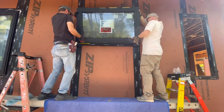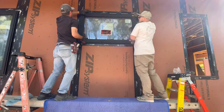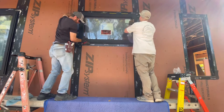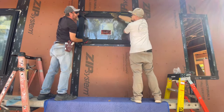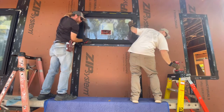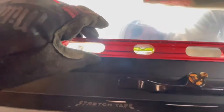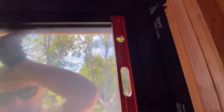We're just careful with it, careful with the windows, wear gloves, and try to protect the window the best that we can. Our next step is screwing the window in place. We'll get one screw up towards the top. But before doing that, I'm running inside to check the level — always good to double check. Once I establish that we're all good with the level, no extra shims needed, then it's back to screwing the window in place.